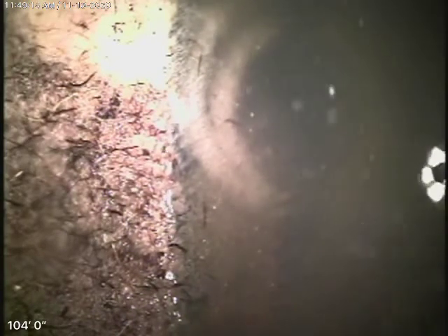This is video number two for 201 17th Street. The homeowner gave us permission to hydrojet the sewer line, and that's what we did. There were very heavy roots at the end of the line — we got about 90% of them out. Right now we're looking at the city connection, the city sewer, which is about 15 feet deep in the easement in the back.